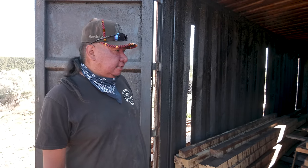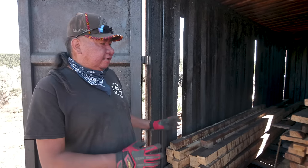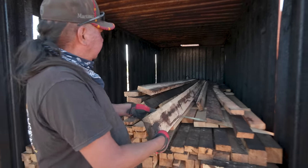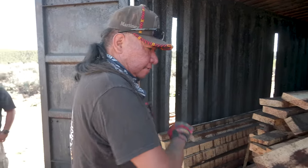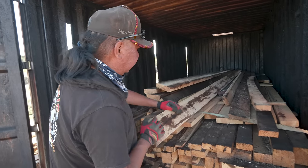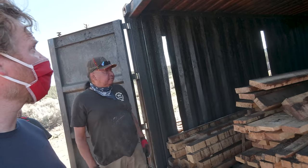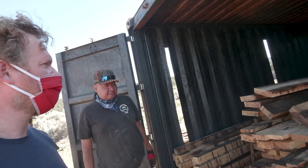It's still acting as a dry kiln — we're bringing in the heat so they're drying. I'm still figuring out how to bond the boards and make them come out straight, because some of them warp and twist when you don't bond them down. We've got packing straps — we put slits in the side so we can run the straps through and drag the loads. In between each layer there should be a spacer to get air all around the boards. The idea is to fill these things up and alternate, because you want a certain amount of heat and smoke to start preserving them.